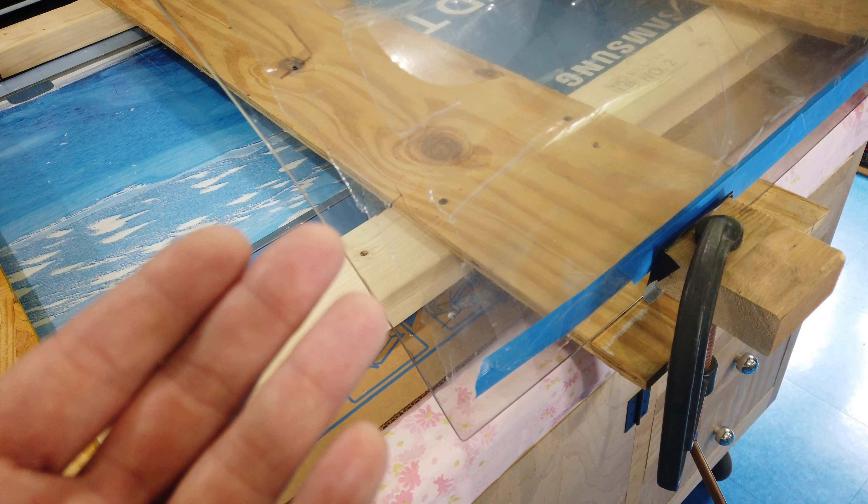Now that I've got my microstop set to the proper depth for my aluminum strip dimple, I'm going to countersink all of these. I have to deburr the backside first because the pilot on my countersink is an eighth-inch, so I'll do the countersinking while these holes are still eighth-inch. After countersinking, I'll open these holes up to the final diameter for the number six screw to cleanly pass through using my unibit - I may have to come at it from both sides since the unibit steps aren't deep enough to go completely through the plexiglass.